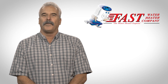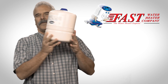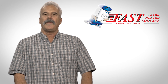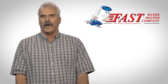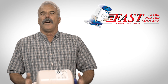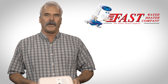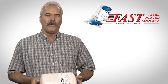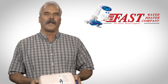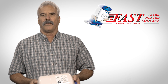One of the most common items you may need to have installed with your water heater is a thermal expansion tank. This mounts on the cold water supply piping going to the water heater. As your water heater is heating the water, as temperature rises, so does the pressure. This excess pressure causes stress on the plumbing in your home as well as your water heater. The thermal expansion tank has a rubber bladder in it that's charged with air. So now when your water heater heats up to temperature, as the pressure is rising, the expansion tank absorbs this excess pressure, taking the stress off the plumbing fixtures in your home and your water heater, which prolongs the life of your water heater.